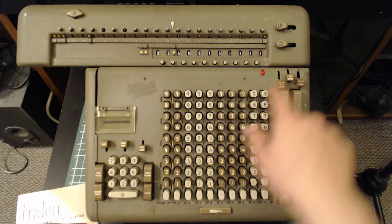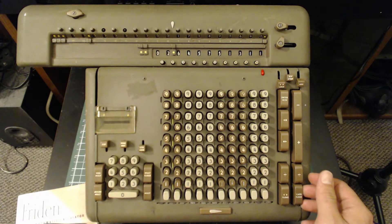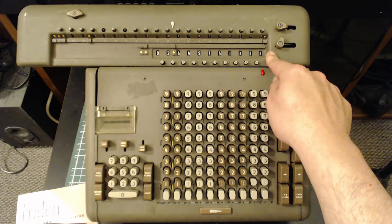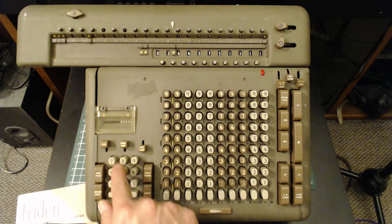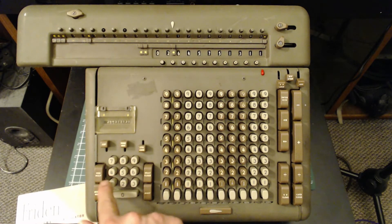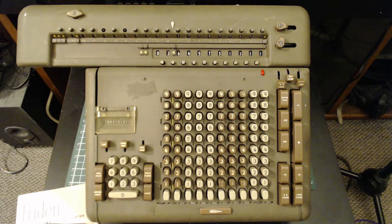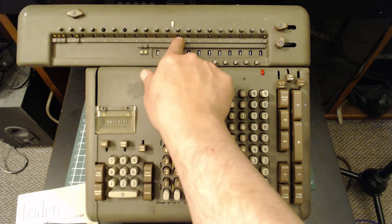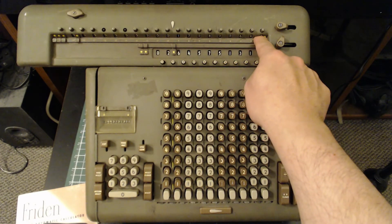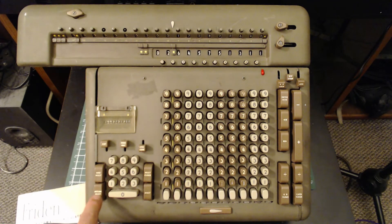We can lock the keyboard to not lose it. We switch this so that the carriage clear won't clear the lower register, and then we can multiply it. I'm going to use cumulative multiplication because it's going to keep the remainder we had, plus add the results of multiplying these two things together, and it will get us a bit closer.